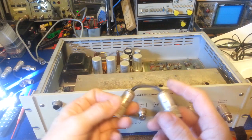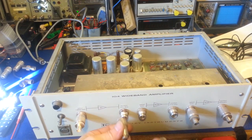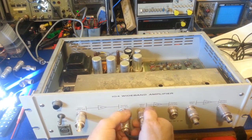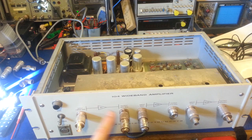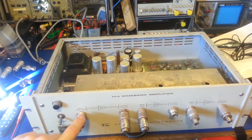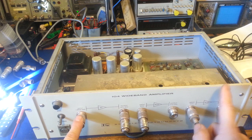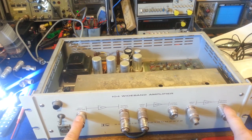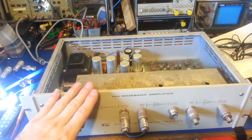What you do is cascade these or run them in series - that's the way they're designed. Actually back in the day this is one of the original jumper cables that would have come with this. You run the output of one straight into the input of the next, and then do the same thing again - run the output of this stage into the input of this stage for maximum amplification. This is just your 1x which gives you the high input impedance of the vacuum tube. That's why they used a vacuum tube - tubes have really high impedance. Then if you only needed 10x amplification you could take your output here and run it over to your test equipment, or if you need even more, run it into the next stage multiplied by 10 again. With a spectrum analyzer, modern ones you really don't need to amplify because the levels go down so far on those.